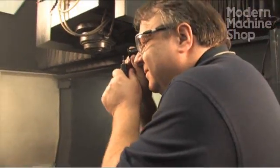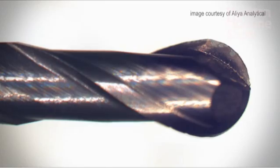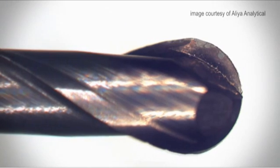Little to no wear again, so we've increased the feed rate double. Now we're going to try and go a little bit faster still, possibly look at increasing the depth of cut and going back to where we were in the beginning. If you see chipping on the cutting edge, even in small amounts early in the cut, it can be an indication of too fast a feed rate.